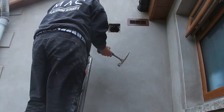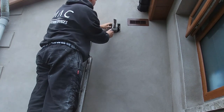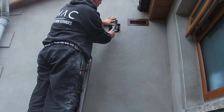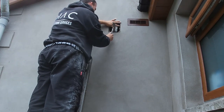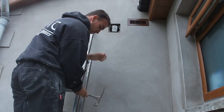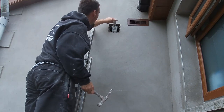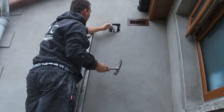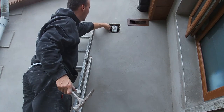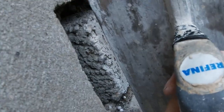The way I like to fill these is to get it tight enough so you can tap it in. Especially on a job like this where the render is over old pebble dash, you don't want to go too mad or you could potentially loosen other bricks. I like to have it tight enough so it's pinched in even before the sand cement goes in around it. You can use other bits and pieces to pack it out. I want it sitting so it's not going to move, then I'll really point it in with that super strong sand cement and get it well pushed in around the edges so no moisture can get in.